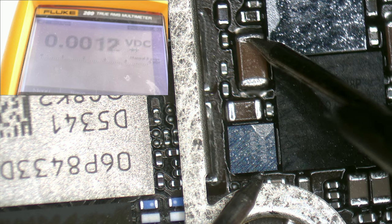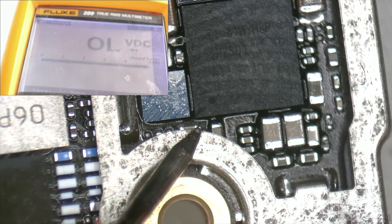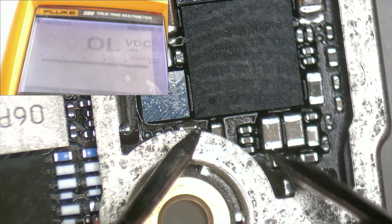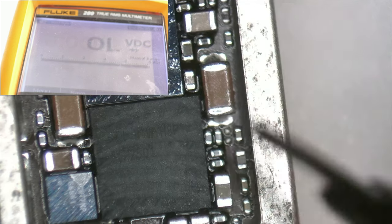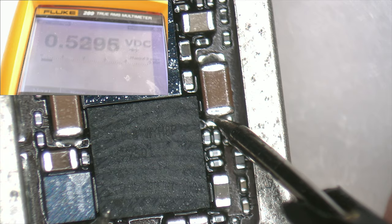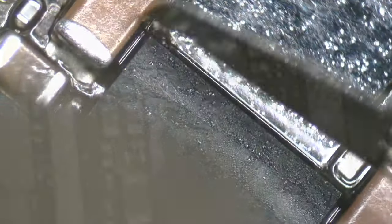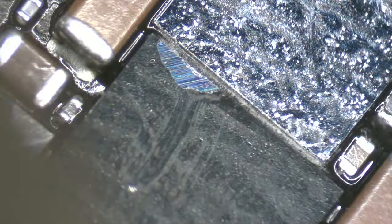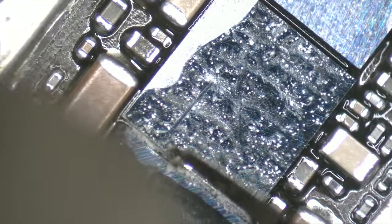So far, all indications suggest that the circuit is in good condition. The circuit we detected that was intermittently heating up is the one we are going to pay attention to. So, our task now is to look for capacitors in short circuit in this area. We discover that these two capacitors are in short circuit, indicating that the line is in short.